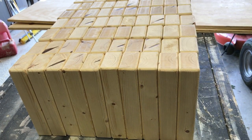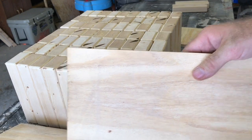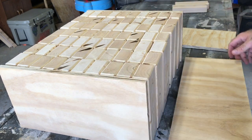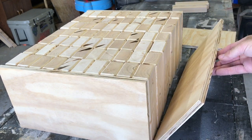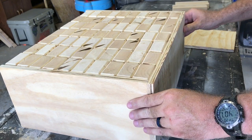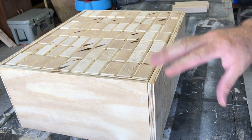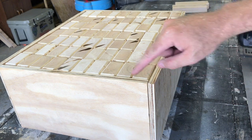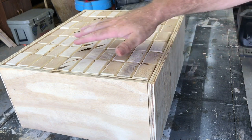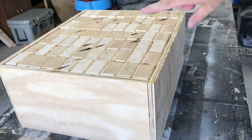Basically what I'm going for: here are the two sides I cut out of half-inch plywood, they're gonna go on the edges. Then this piece I cut is going to go up to the back side and butt right up against it, and this one will go on this side — so that's the four walls of the carrying case I'm going to use. Of course I'm gonna have to measure across counting the half-inch plywood so I know how big to make the bottom for all this to set on. I'm gonna go ahead and measure and cut the bottom piece out.